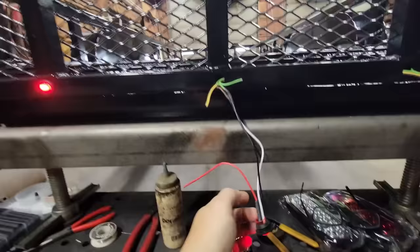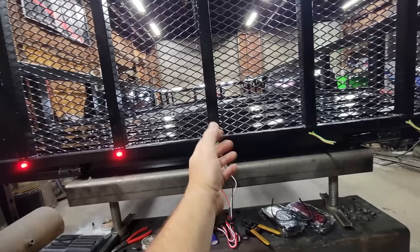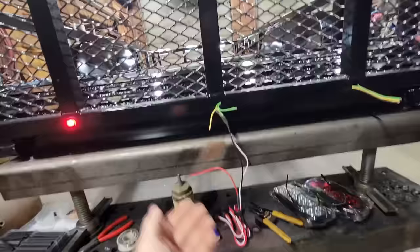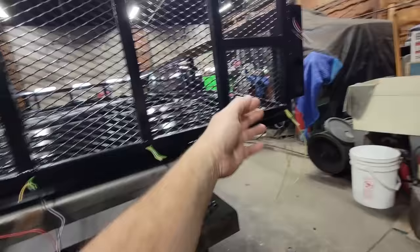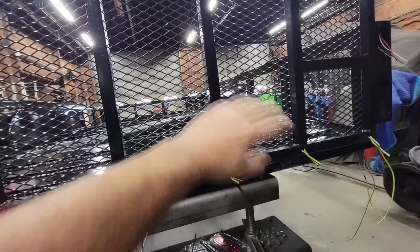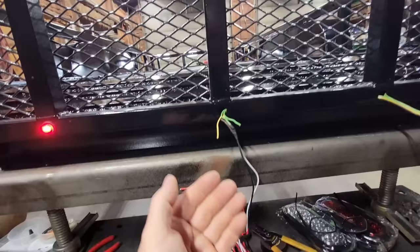I'm now at the center light — the one in the middle of the gate. This particular light requires something a little bit different. The marker light is on right now. Because I have an odd number of lights across here, I want this middle one to flash as a four-way, as a left turn, and also as a right turn independently. The problem is if I just connected the left and right turn signal wires together, when you turn on the left side turn signal it would turn on all the turn signals on that side. Depending on the vehicle, it could back-feed and turn on the other side's turn signals as well. So we have to find a way to stop the electricity from going where we don't want it.